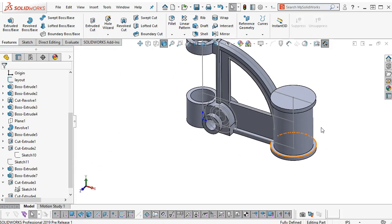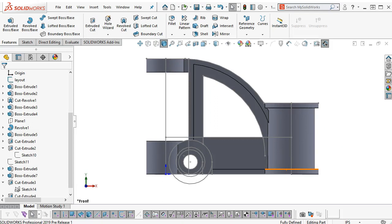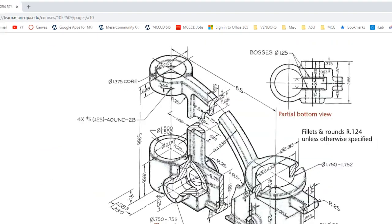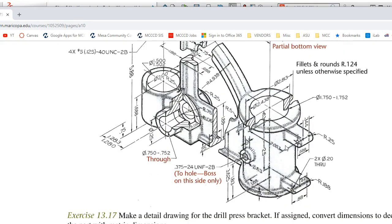And then last, on this segment anyway, we have the through hole, but I am getting ahead of myself and trying to overlook some of the geometry, so Control minus there, and that will fly it in. So we still have the two little bosses on the end, and our boss at the center. Alright, so we can put those in on the front plane. And I think I want to do that just because of the potential going through the intersection. And we'll do all of that before we put in the 1.75.